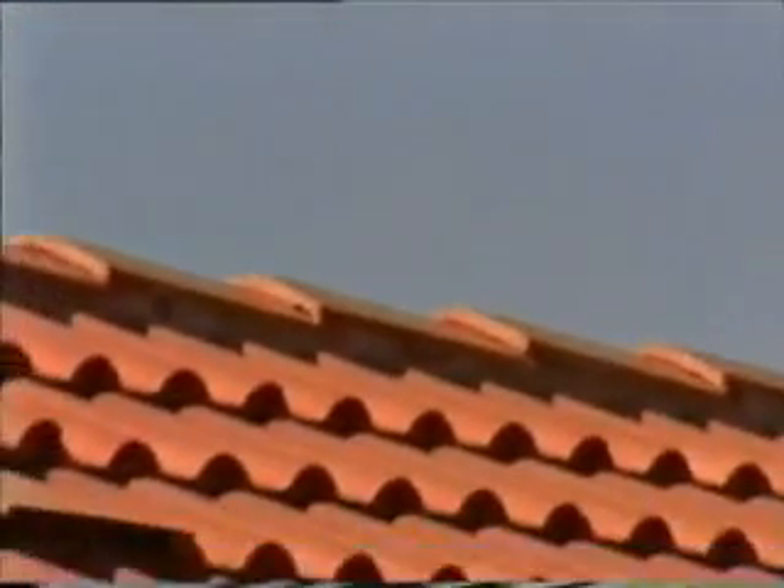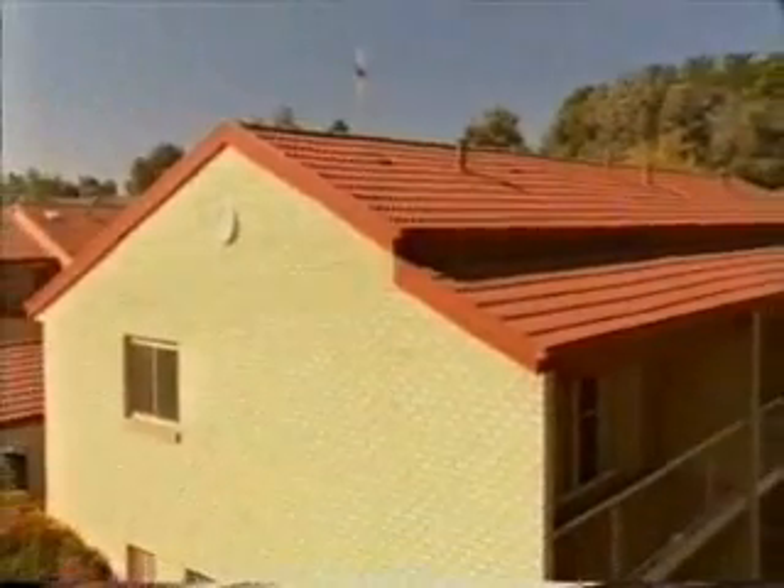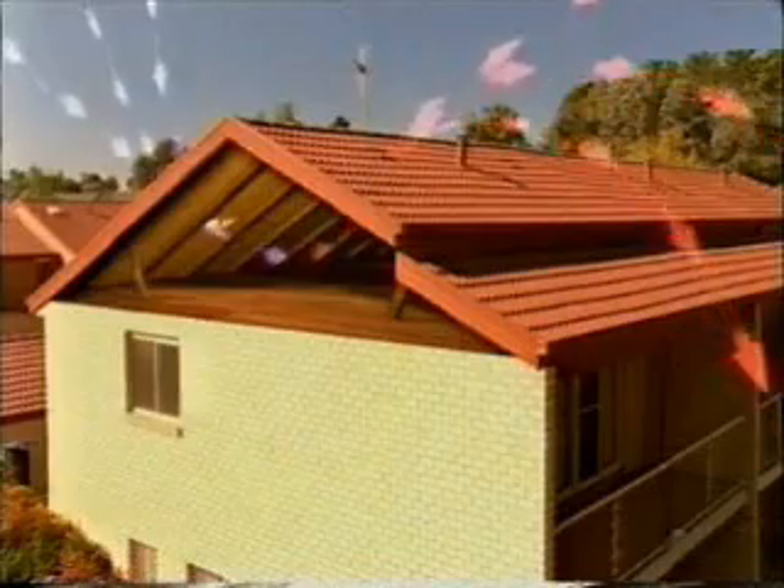The tiles are placed on opposite sides of the roof, with one side positioned slightly higher than the other. The lower tiles draw cool air into the roof cavity, forcing the hot air out through the higher tiles on the opposite side. This natural flow of air means that the roof is constantly ventilated, even when there isn't a breeze.